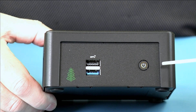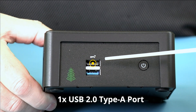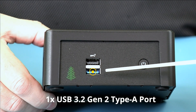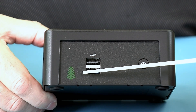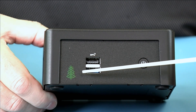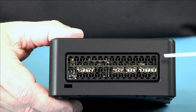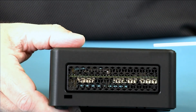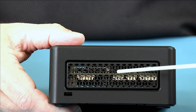We have our 90 watt power supply. Starting from the right side, we have our illuminated power button, a USB 2.0 Type-A connector, and a USB 3.2 Gen 2 10 gigabit Type-A connector. On the side, you can see a large air ingress area for cooling, and the top and bottom of the board are both exposed, which helps with cooling in industrial applications where there are higher temperatures.